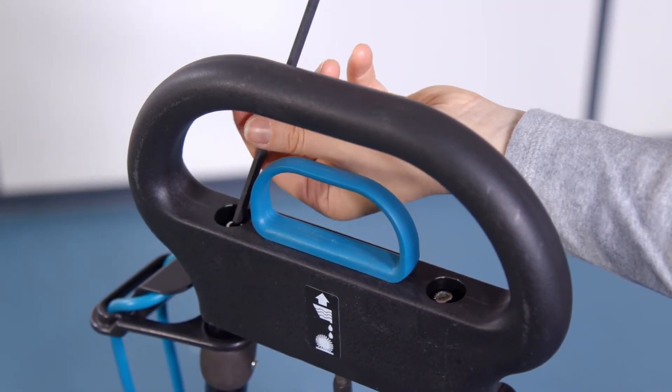To stop the machine, bring the handle back to the upright position. Move forward while sparingly pulling on the solution discharge control handle. By pulling the lever up, cleaning solution is dispensed onto the floor. The solution will stop once the lever is released — this shouldn't be kept pulled all the time. The duration and frequency should be adjusted to suit the floor type and extent of dirt.